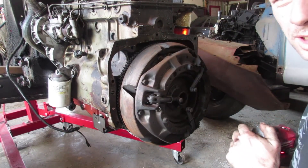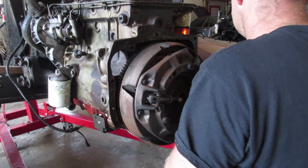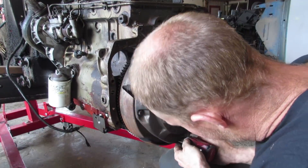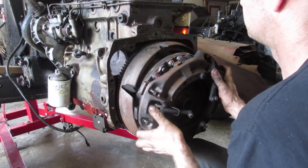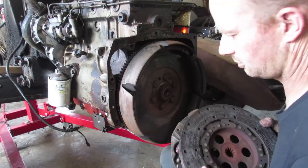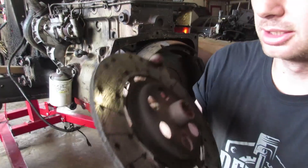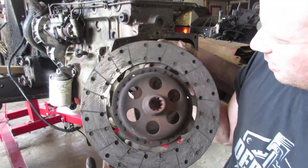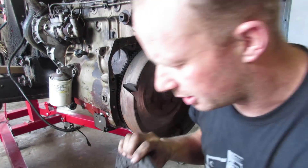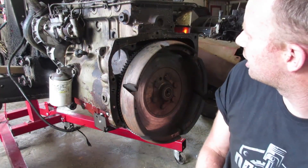It's always a good time to look at the clutch and order a new one. Take it off evenly. Actually, that looks really good - far from hitting the rivets. I don't think you're going to worry about it. The other one's PTO, and it looks good too. Take the flywheel off - the crank's got to come out, might as well do that.